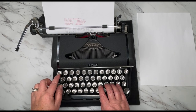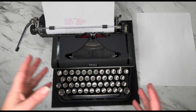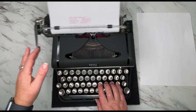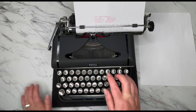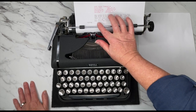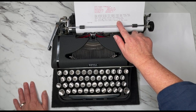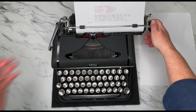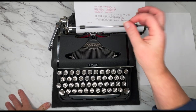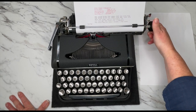I'm at the margin release. What happened is I'm typing past the margin and the typewriter is wanting to stop. So I'll hit the margin release and I can keep going. Obviously my margins are different than when I did this before — sorry for that little hiccup, but it's good for you to see because you're going to run into stuff like this. Initially I had the paper too high, then I brought it back down. That's what this button is for — to help you line things up. I'd test the first few times so you get to know your typewriter and how to line things up when you reload paper.